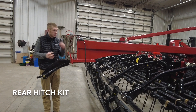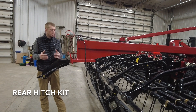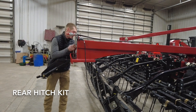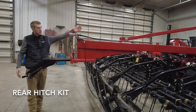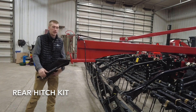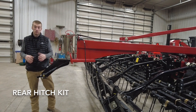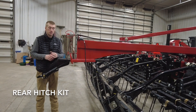Another great feature of the Salford tillage tools is the rear hitch option. If you want to pull a packer or a rolling basket behind the tool, this beefy rear hitch makes that extremely easy to do. We've got our light hookup here, our hydraulics for whatever implement you're pulling. I also really like the hookup assist feature — this insert pulls out and if you're a little bit short, you can just pull this, and once you get hooked up, you back the tool up and it locks back in place. We've got safety chain hookups and the swivel hitch. The way it integrates into the mainframe makes it look really sleek but extremely heavy duty.